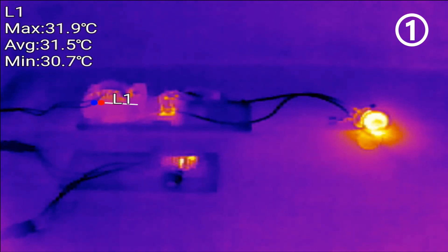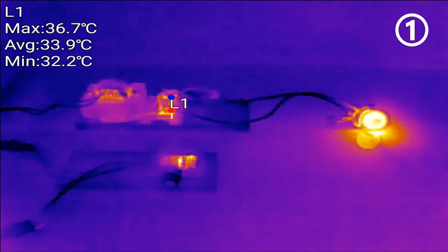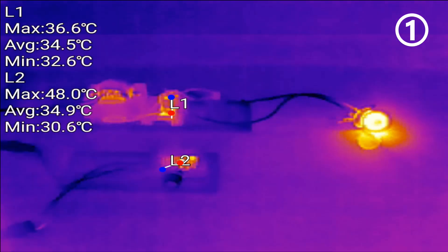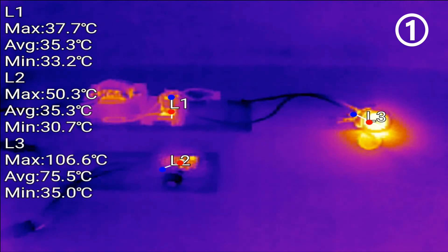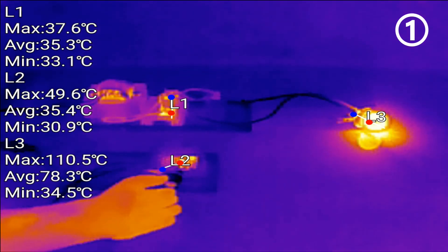Temperature of the transformer — it's fine. Temperature of the rectifiers — a little high, 36 degrees. Now that of the speed controller — we can measure two different temperatures at the same time. The speed controller is reaching 50 degrees and the rectifier is reaching 37 degrees. Let's measure the bulb also — we have L3 at 107 degrees, then 110 degrees. That is quite high and we are still not at full power.